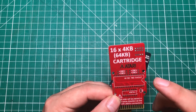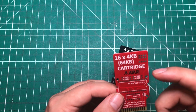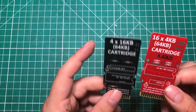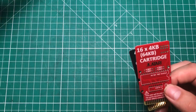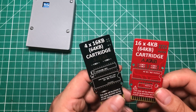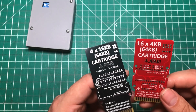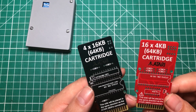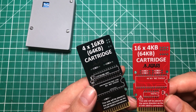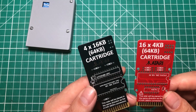The second thing I didn't really love about the original cartridge is that although 16 games seems awesome, it's a lot to switch through — you have to keep cheat sheets around or put big stickers on the cartridge to know the right switch combination. Getting the jumpers or DIP switches in the right position is a hassle, so this new one holding four bigger games — any game up to 16 kilobytes — I think is actually going to be an advantage.